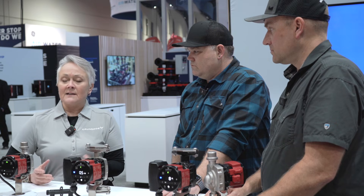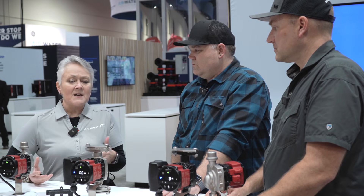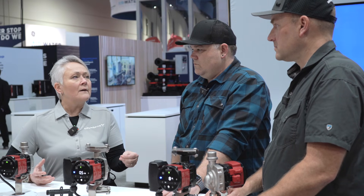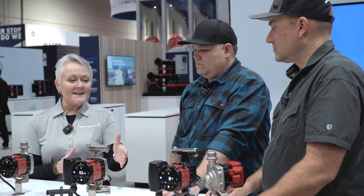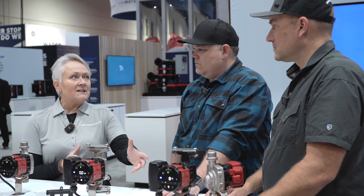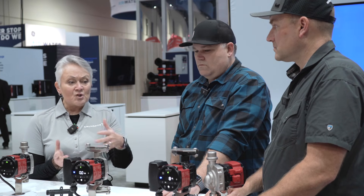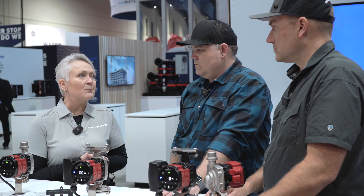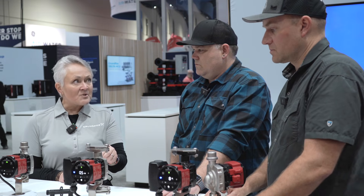There are at least three heating sources I can think of right now. We've got tankless water heaters, tank, hybrid combinations, heat pumps, and every one of them have different firing options and it isn't as simple as just saying I want speed one or I want speed two. So what we did was we started with: what does a domestic hot water circulating pump need to do? It doesn't have to flow at 15 gallons a minute. For most homes, it's maybe only one gallon a minute. So why would you have a pump so big using so much energy pushing that much water when you're going to high fire your tankless or you may even kick your heat pump water heater out of eco mode? So what we did was we drilled down into speed regulation and temperature control.